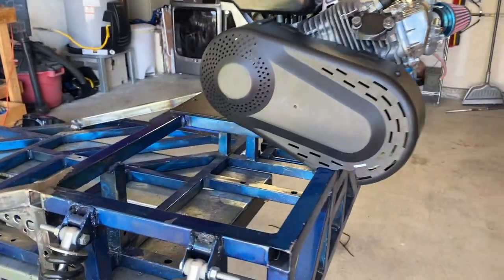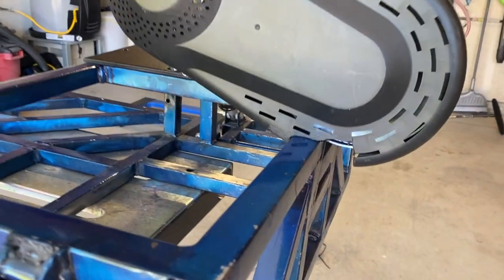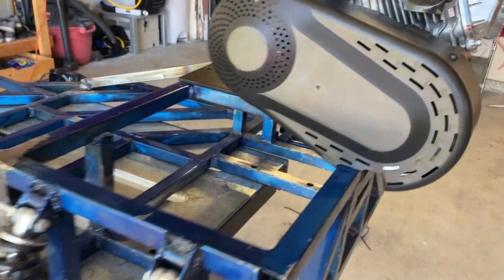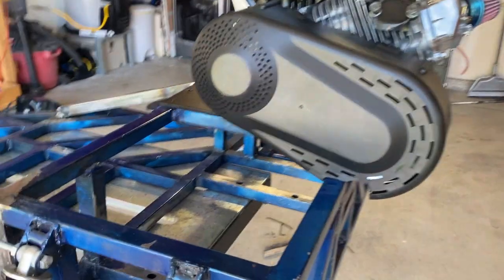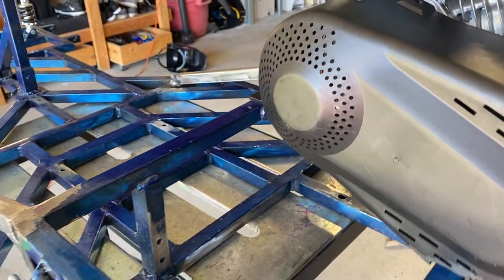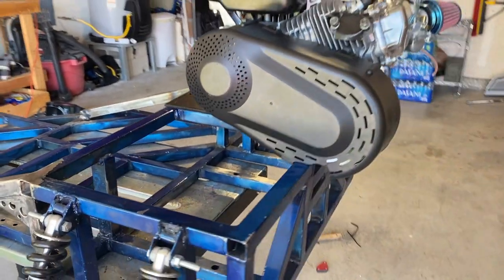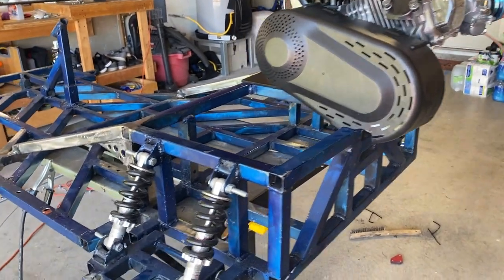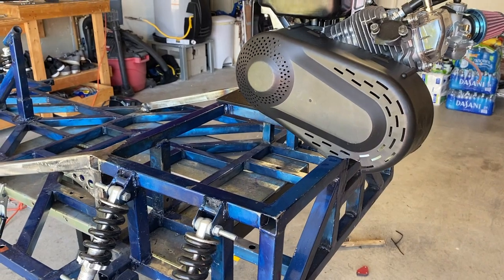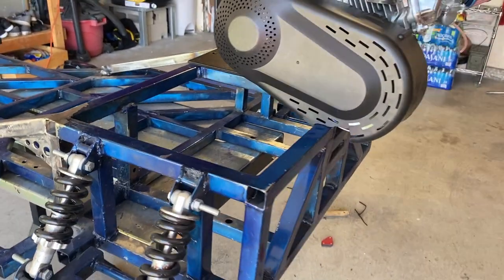But basically the torque converter cover is very close to fitting nicely. It is just slightly fouling on the back frame there with it in the fully back position. It's not off by much. I just have to push it down a little bit to get it to seat on the frame of the torque converter. So I'm going to go on the mantra of work smarter, not harder, and just notch that piece out with a Dremel tool when it comes time to mount it, instead of going in and notching a bunch of the frame up.